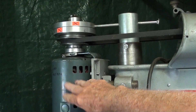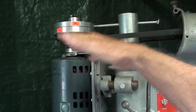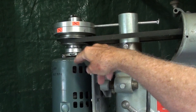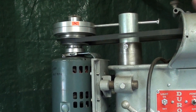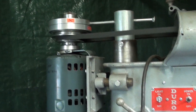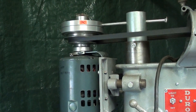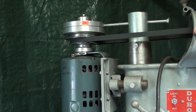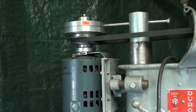This is a 1/3 horse split-phase motor, and it doesn't always have the starting torque to even get going, because there is some load imposed by the gear reduction. I need a capacitor start motor, so I'll be changing motors when I find one. The whole idea here is slow speeds for large drill bits so you don't burn them up. I'm also going to do a video on hole saws, because large hole saws need to be run at a very, very slow speed.